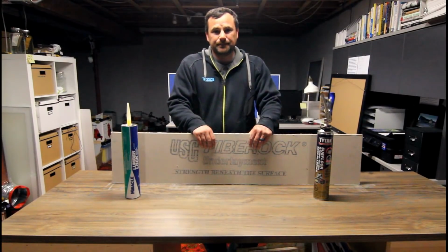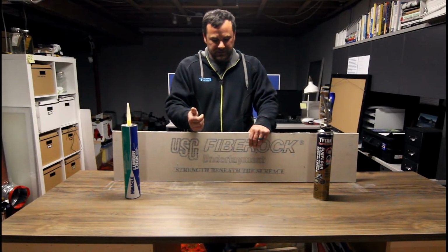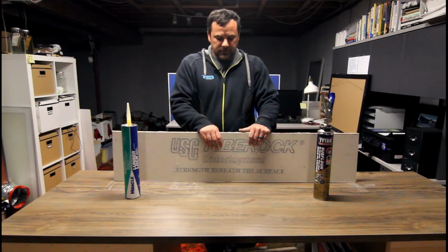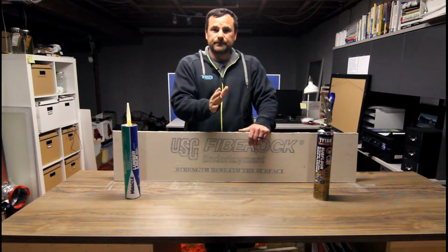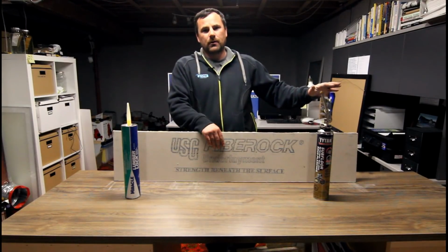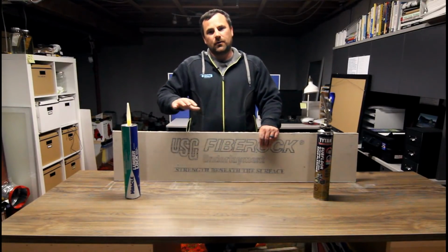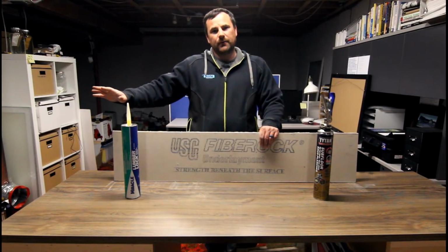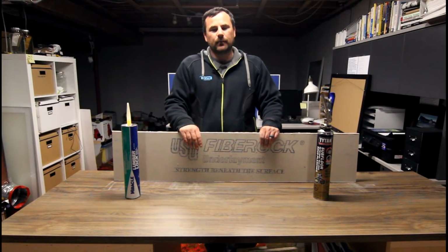It's water resistant, but it's also good for vinyl planks, linos, that sort of thing, right? So you have the water resistance, the rigidity, a multitude of uses. I find that very useful. It's got a price point right down the middle, so it's a very good price point. Over on the inexpensive side, you have particle board that doesn't have any water resistance, but it is cheap. And then you go to the tried and true plywood, a little more money. I feel like that would be fairly water resistant as well. You can tile to it and you can do vinyl plank and that sort of thing.